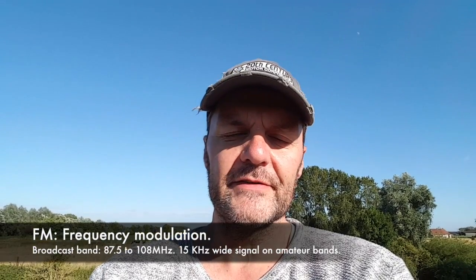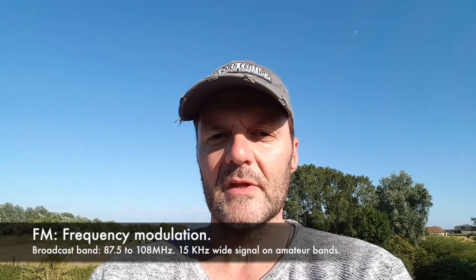So what can the 2 meter band do? Well, it depends what mode you use and which antenna you use. The antenna is everything, and that's true for VHF as well as HF — for everything, actually. The mode is important too. Take FM for instance — same as your broadcast music station — it's very wasteful of power, it's a very wide signal. Of course radio stations don't care, they have plenty of grid power, but us guys don't really care if we sound a little bit like Donald Duck, as long as everybody understands.